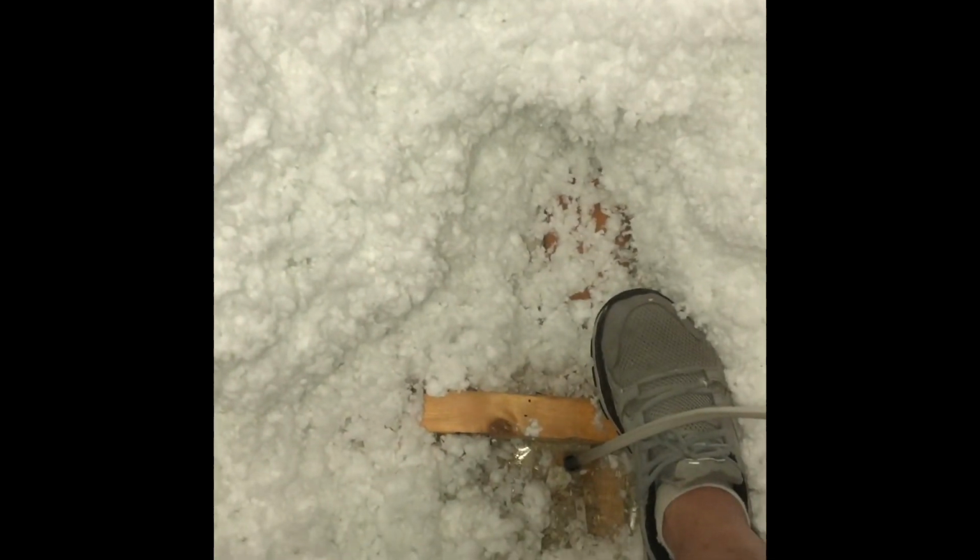So what I'm going to do is I have my length that I want. I'm going to clear away a pathway here, 86 inches down that direction. I'm going to end up boring through the studs or the trusses. Well, I guess, yeah, I'm going to end up boring through those guys and feeding this through, and then feeding it down the wall to where my new box is going to be. So that's pretty much where I'm at right now. So I'm going to stop the video and run it through, and then pick up where I'm getting it into the new box.